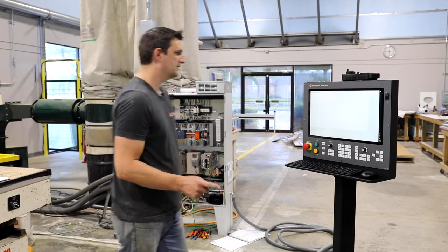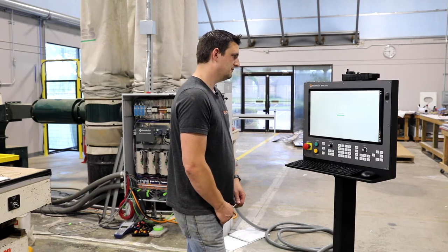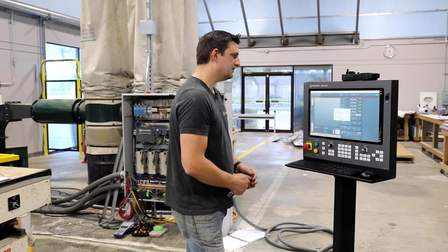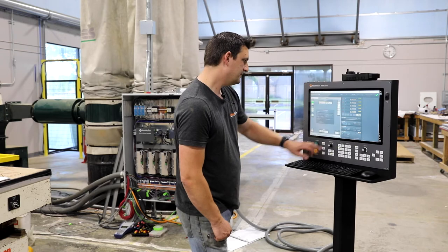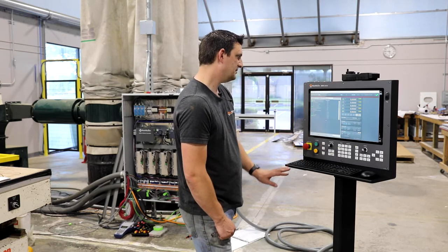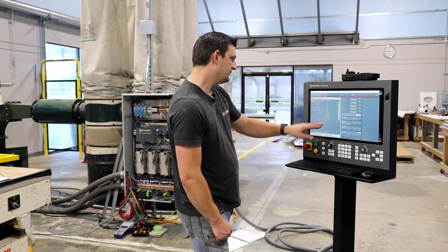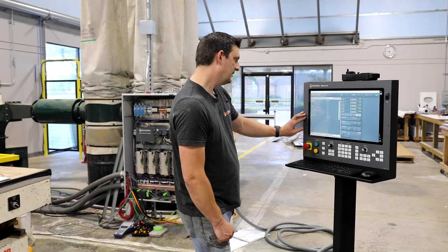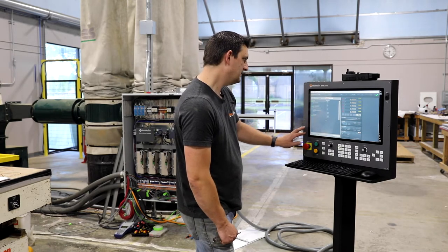I'm gonna grab a screwdriver just to test some of the proximity switches. All right, so this is our first startup. We're gonna go over and see what I/O has been mapped. Go to machine outputs. And we've got our output signals mapped. Most of our inputs are not mapped. We've got some for the tool changer, on the spindle, just the drawbar, unclamped and clamped.